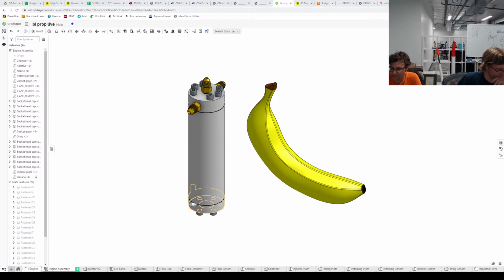So it looks like we were able to solve a big problem we had with our fuels. One big change we made was to our injector. It was two pieces, and in the early stages it was actually three pieces. We narrowed it down to one single piece. This will take care of some of the sealing concerns we had, and gets rid of a lot of the graphoil gaskets that could potentially clog the nozzle. That's where we're at.